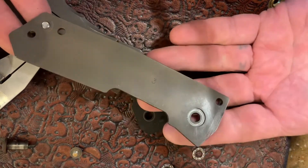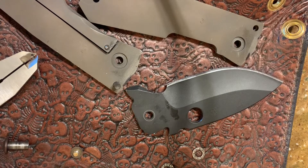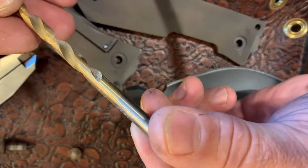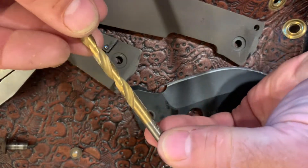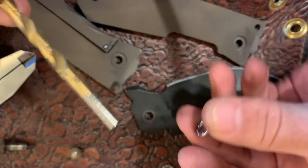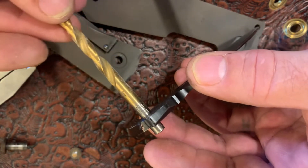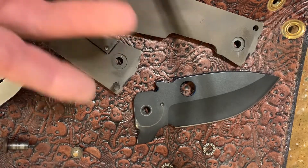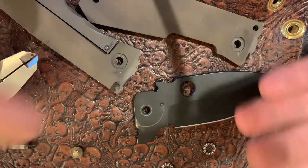My eyes are bad. So that's a basic tutorial on how to measure for bearing pockets and how to use calipers. You can use gauge pins, or if you don't have gauge pins, use drills. Here's a quarter-inch drill — take a quarter-inch drill and see if it fits in your bearing. You can see it fits in that bearing pretty good, so that's probably what the ID is. You can even take that same drill and put it in your blade hole and see how it fits — just a little snug, a little wiggle, so that hole is a little over 250 thousandths. A few ways to use simple tools to figure out what bearings you need for a used knife.